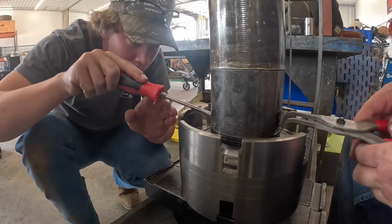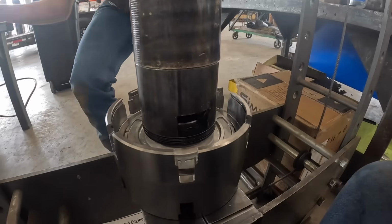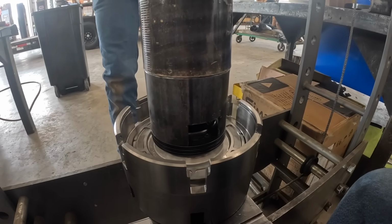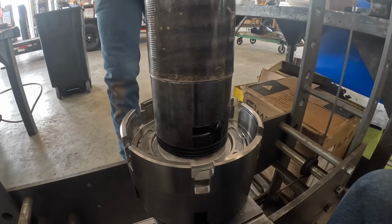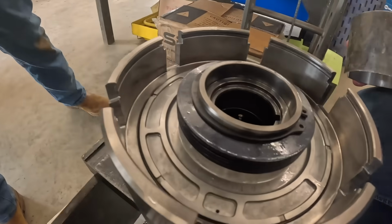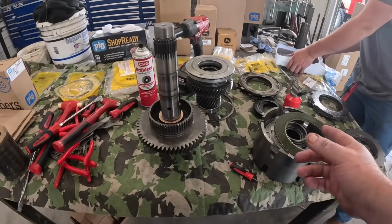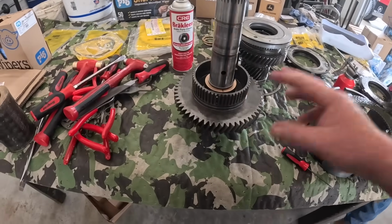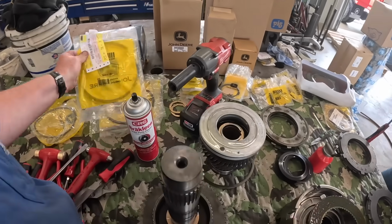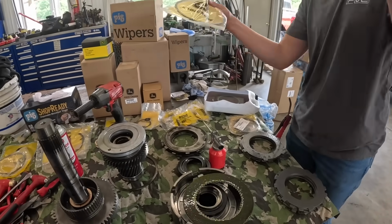Okay. Is that it? Feel good about it? It's good over here. Okay, looks good over here. Okay, and back that up. Looks good. All right, first thing we're gonna do, we're gonna start stacking clutch disc on this, and remember we gotta press that on here. First thing we're gonna need, Hunter, is one of these big monster snap rings. Get one of those open.